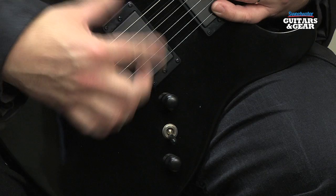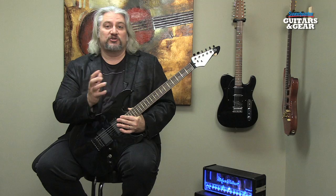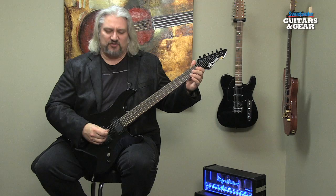With the tone control pushed in, the auto-tune technology is engaged. We have a hexaphonic pickup mounted inside the bridge, and that senses the pitch of each string individually. Those individual pitches are sent into the circuitry inside the guitar, which then tunes those strings up to standard pitch or to another pitch if that's what you want to do.